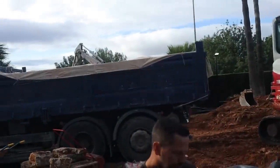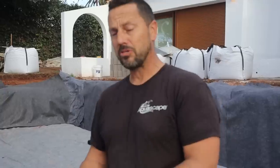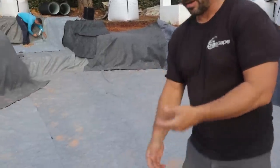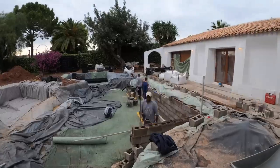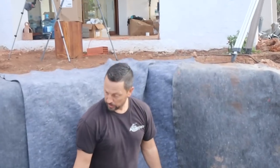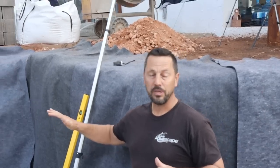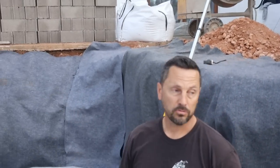Explain to everybody why we're doing the fabric and sand. The past four days they've spent hammering all this rock out here. When they're done it's not going to be a very even surface — it's going to be kind of bumpy. We're putting down this fabric as a protective layer to keep any loose rocks from migrating up into the sand. Then we've got a sand layer, then we're going to do more fabric on top. We want to make sure nothing from below comes up into our liner. We've got two seams that have to be done here — one coming from the deep stream, one going into our intake. A 50-foot-wide liner by a hundred. We're going to go down onto our wetland, create our waterfall and everything on the backside. Areas like this can suck a lot of liner in, so we're going to raise this up a little bit, figure out our elevation for the wall, and make sure we keep the liner close enough to our existing stream liner to do these seams. Once that's done, they can start building this wall — that will be a huge milestone because then we can start setting boulders and get this thing rocking.